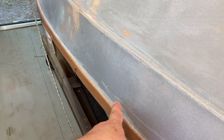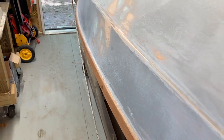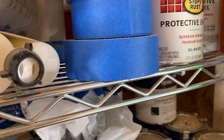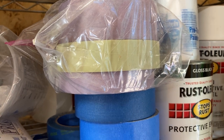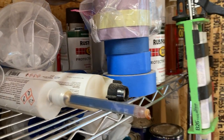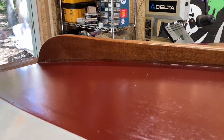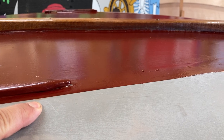Some people with good brush skills could just go right along the edge without masking, and does anyone really care if they're looking underneath the gunnel? No — but as sloppy a painter as I am, the paint would end up on the side where it'd be seen. So it's easy to just run some tape. For general masking, use good old blue masking tape. But when we go to do the line between the bottom paint and the side paint, we use higher-dollar tape — one is a fine line and one is an easy release. With fine line you press it down and don't get paint bleed under the edge; with quick release you're not peeling off your new paint job. Jeff of Two Daughters Boatworks gave us those tips years ago.